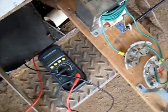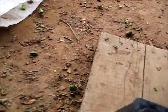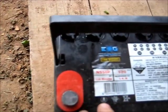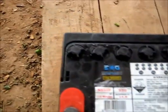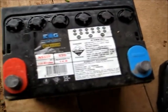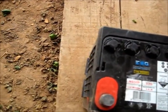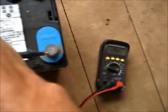Switch off, disconnect, measure the voltage. Now if there's a short in that cell, it'll probably be hot — but it's not hot. Excessive cranking and rapid charging for no reason will also cause cells to short out. When you charge the battery again after that, they'll get really hot, and that's not a good thing. That can be very dangerous — that battery could explode. Heating a battery like this is not a good thing, especially if there are shorts, because if it sparks internally and there's hydrogen gas involved, it'll go bang.